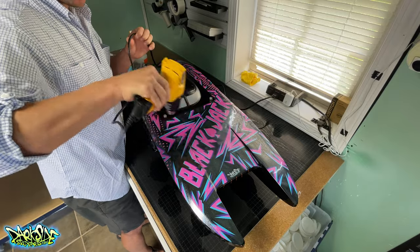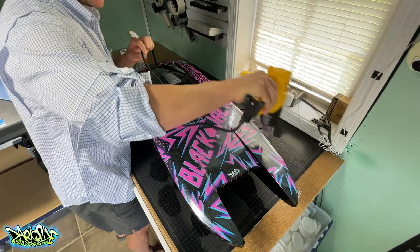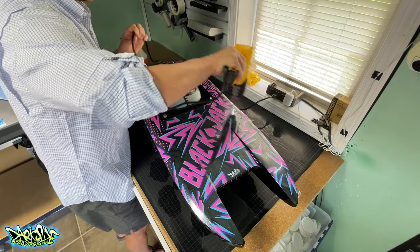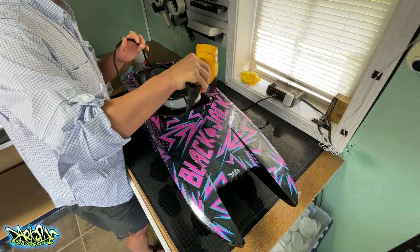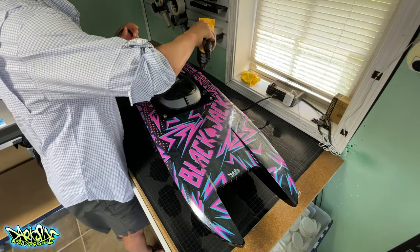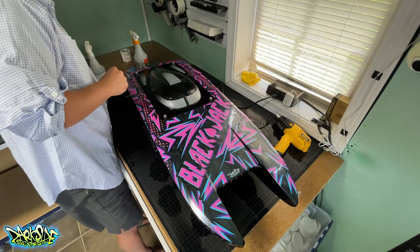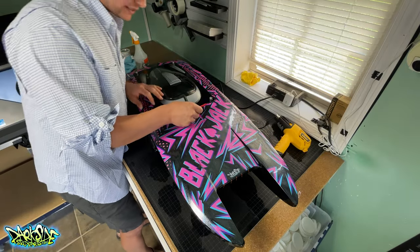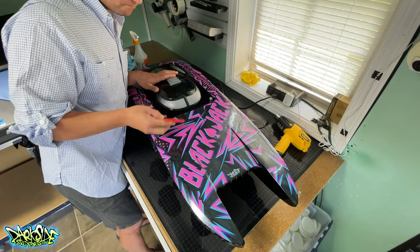So it's kind of cool in my room. It's room temperature, 72. That's a good temperature to install this stuff on, because it keeps this fairly rigid while you're working with it. But when it comes time to lay it down, we need to soften it up. Now, you could say, well, Jared, what if I do it out in the sun, you know, on a nice day? It's 90 degrees outside. Well, you can, but the problem is that 90 degrees is going to make this material real soft when you go to lay it down. It might make it harder.